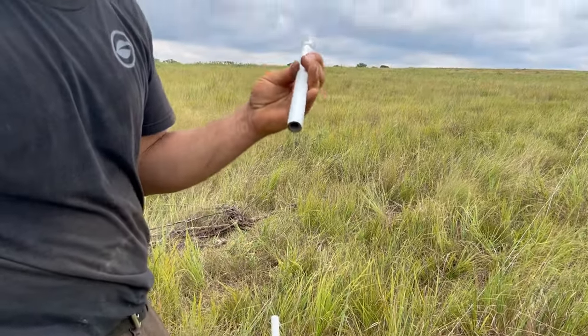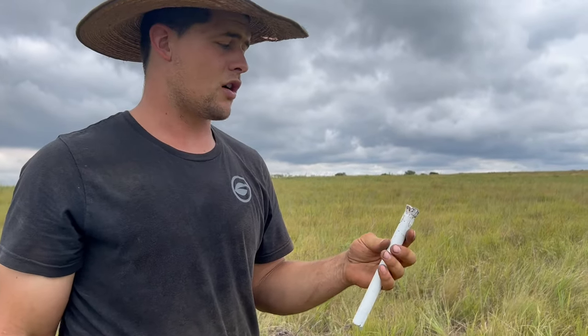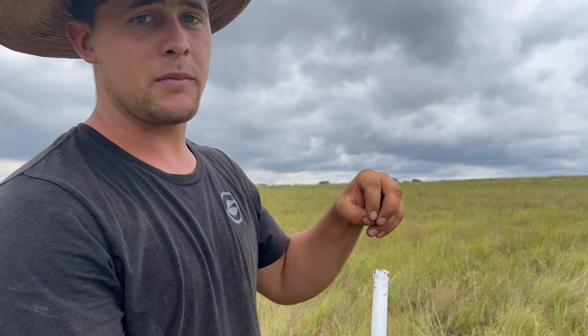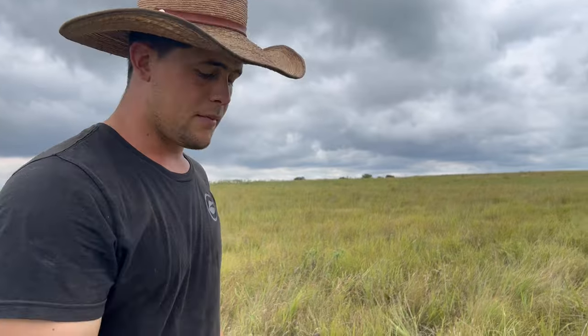You've got to either get one of these from our website, Farm Tough Leatherworks, or build yourself one. But you can't just weld the bolt head — you've got to drill some holes and weld through the side, because I built one and I blew the end off of it. There's a lot of force going into these posts.